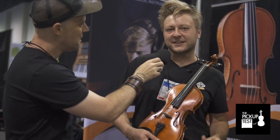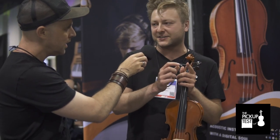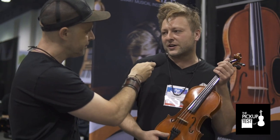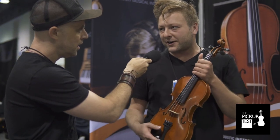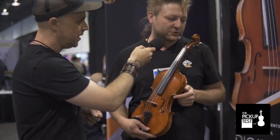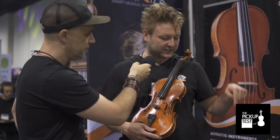We're using the same type of microphones you can find in every iPhone or iPad. It's the newest technology called MEMS microphones — a very small microphone which has the ADC converter built in, so it converts the analog signal to digital already on board. It doesn't consume much power, it's very efficient, and the sound quality is just amazing for that size. And you don't need any audio card with the system, because the wireless audio comes directly to the computer.